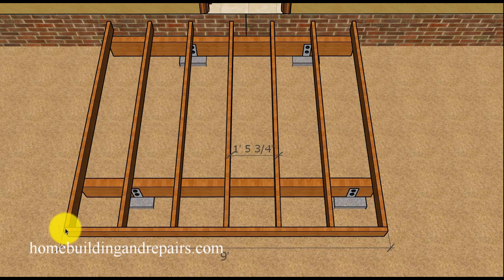If you have 12-foot lumber that you're using and you're going to be cutting a section of it off, make sure that you're going to have a joist that is going to work for the lumber cutoff that you are using. This wouldn't be a problem if you had nine-foot material. If you've got 10-foot material and you're going to be cutting a foot off, just make the deck 10 feet long.